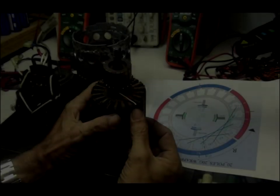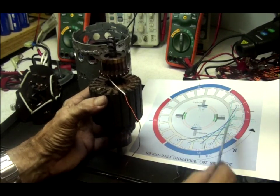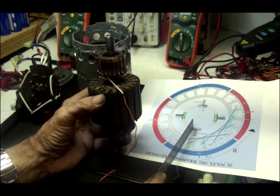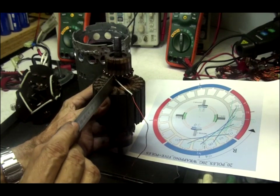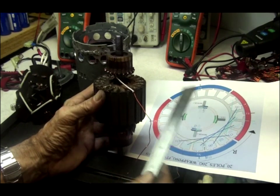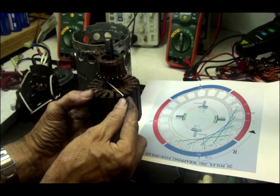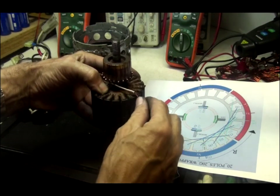Okay guys, I took it apart and I'm going to redo it with another wire. I've turned the picture upside down so you understand — I'm setting G1, which is this brush right here. The commutator element sits right across two poles, and that's the way we have it on the diagrams. That means I'm gonna have to start from one pole away, right here, and grab five poles — one pole behind, which is this one right here.